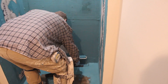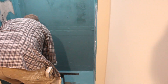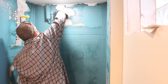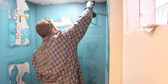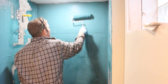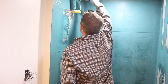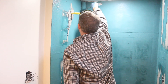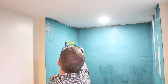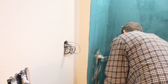Use a 3/8-inch nap roller to roll on additional liquid waterproofing onto the cement board. Try as much as possible to roll it on vertically for the first coat — here we're rolling horizontally only to avoid getting waterproofing on the ceiling. Your first coat should all go in one direction, and then when you put your second coat on, go all horizontal — this fills in any pores. Use a paintbrush to go around the shower valve and mixing valve, and anywhere there are small spots that need filling.